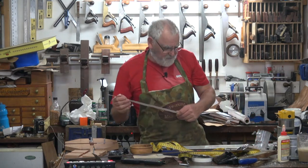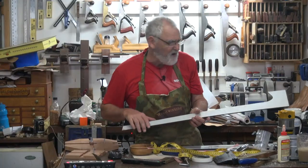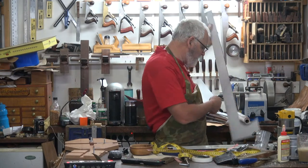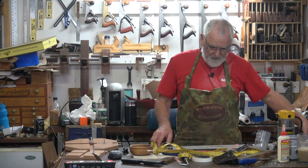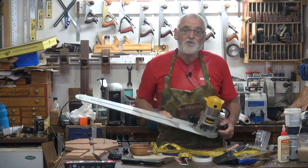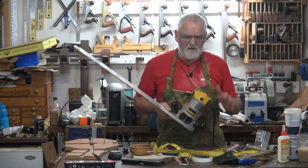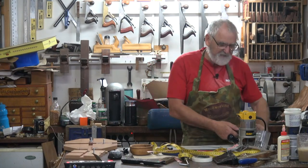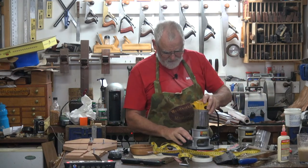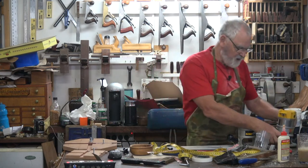there you go. I got a piece, actually a mate of mine's got a cabinet shop, he had a bit of formica left over off a countertop, and I've had this, I reckon, for about 8 years, and I'm just sitting there, I'm never going to use it. And then the other day I was going to make this template out of plywood, and then I saw this stuff and I thought, that's it. So what I've done, I've routed a quarter inch slot down there, and just before I started streaming, I mounted this router, and I think I've got about 10 routers, so this one can stay on here, and if I ever needed it, it's up there because it's a good old DeWalt and Black and Decker one. They're interchangeable, so I can still use the router. I just take it out of here and put it into another holder, so that's not an issue.